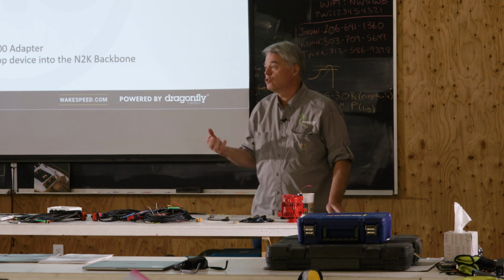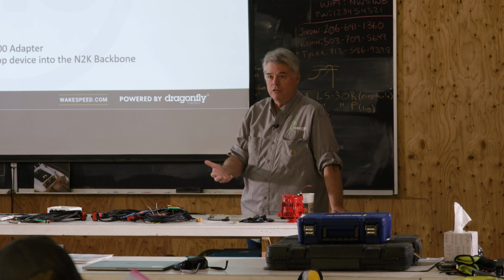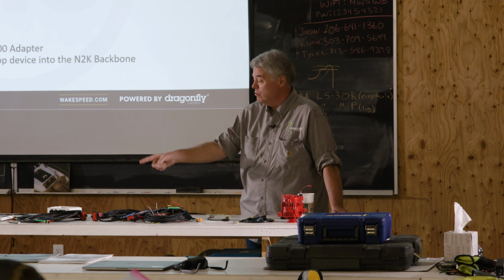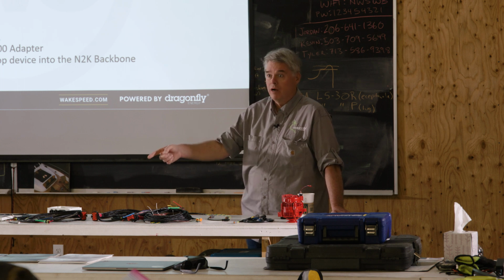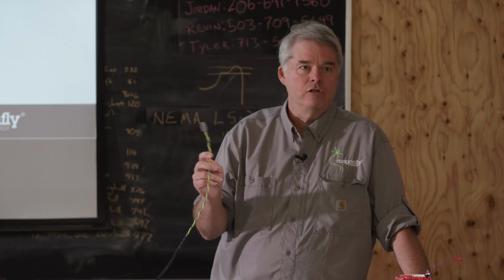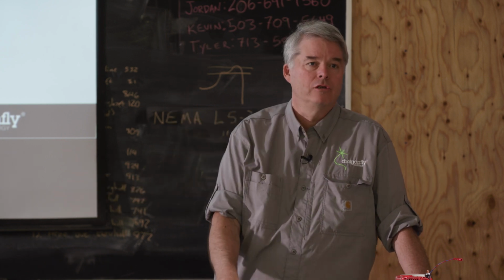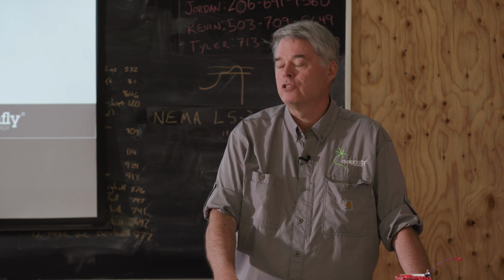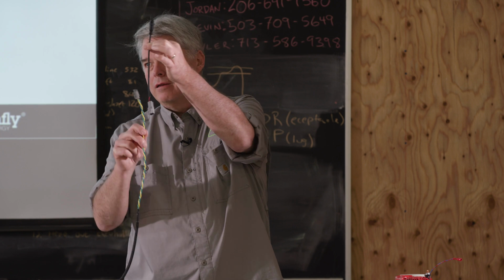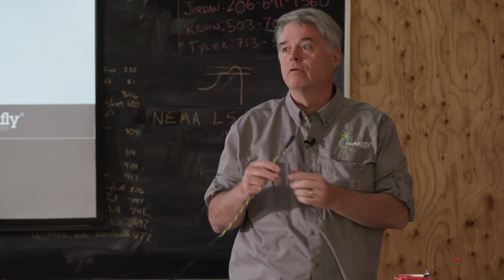So for your install, my recommendation is start with your battery, start with your BMS, start with your instruments. And really the primary choice I think you're probably going to typically make in the marine world is, are you going to do RJ45, which means you're probably largely Victron, or are you going to go to the NMEA standard? And that choice is going to be made on whether you want to have the Wakespeed present its information onto NMEA displays. A lot of people do. In that case, I would suggest a very tidy install is get this adapter from Wakespeed and clip it in, and then get a similar adapter from Victron and clip it in and use NMEA 2000 for your wiring standard.